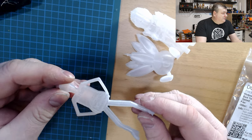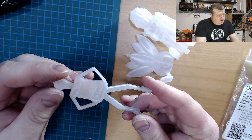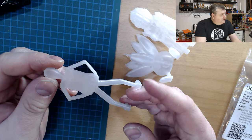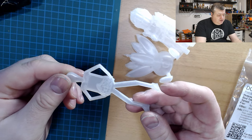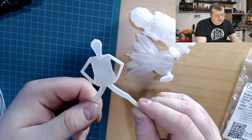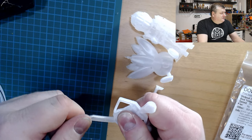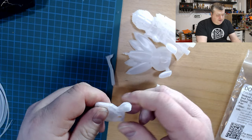I printed my Mr. Belli and on this one I slowed down the print to see if I would get good results, like here in the head part. This came out really nice. So the main thing to get good results with this filament is to print slowly, because you need the time for the filament to cool down. This was looking pretty good — quite strong, quite difficult to tear apart. It flexes and it's tough.